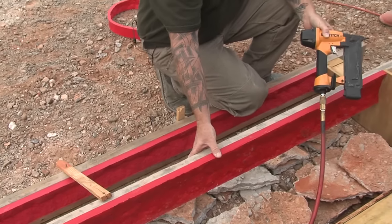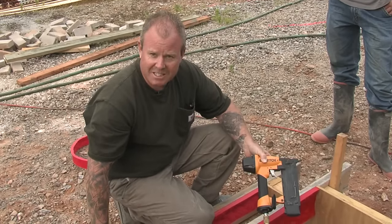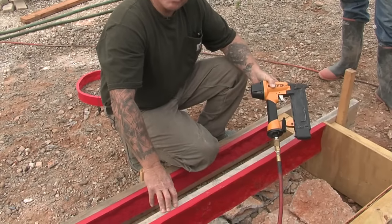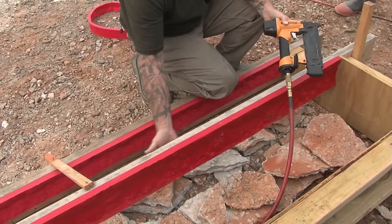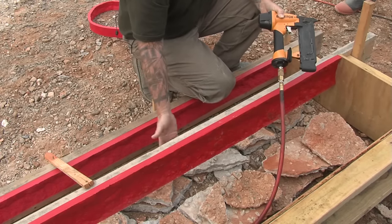Now I will have to strip this off during the pour, where the bottom stair riser can be left until the next day — there's no reason to strip this off. However, we need to strip this top one off simply because we need to finish up underneath it and texture so we don't see that little bit of a gap left behind underneath the form.